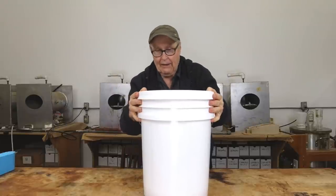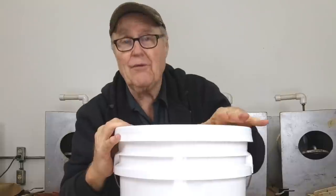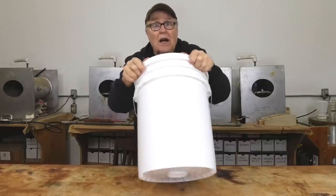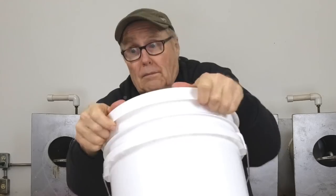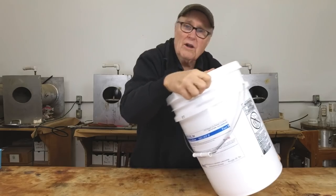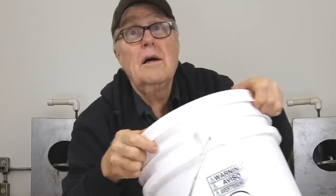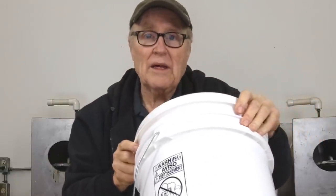I've got my bucket of resin and this is the B-side, so that means we've got to shake it. Now you're probably not buying resin in big 40-pound lots, but we're pouring in production so this is the most economical way for us to do it. That's why we do it, but you've got to shake the B-side. You really want to thoroughly get it mixed. There are solids, or at least there are components in the B-side that settle out. Okay, I'm going to call that mixed and now we can go on to dispensing.